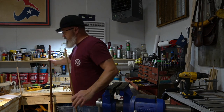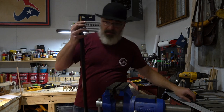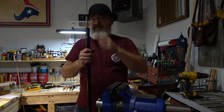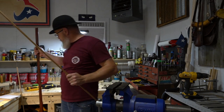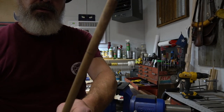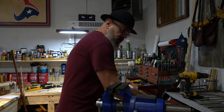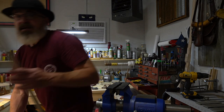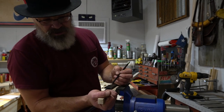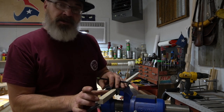The first thing we need to do is get this down in the bore and see just what kind of spare room we have. I'll take my pencil and mark that so I know we have that — give us a little relief from that. That's where we want our handle to set, maybe an eighth inch above that, just so there's a little bit of room. We'll set this aside and take our piece of square block. We'll take our pencil and make a handle size that fits the hand good, and mark that — about that long.